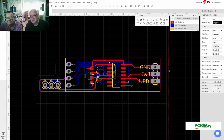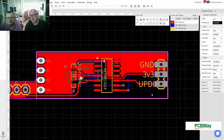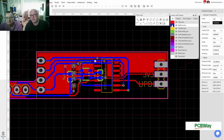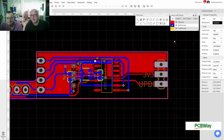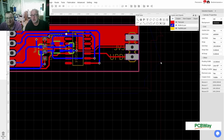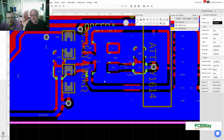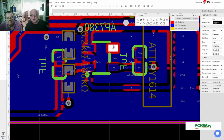And press right. Oh, yeah, this is fine. Okay. Now you think, what's happening there? This is fine because the ground fill doesn't include these. There's no direct connection to this. But if I go to the other side and do the same, ground. So now I'm on the bottom side. Drawing something very creative here. Click and right click to finish. And you see on the bottom side, this is all filled now. A little chip on the bottom side, let me see, is over here. So there's a nice big copper lane. And all this copper down here is all very, very much ground.